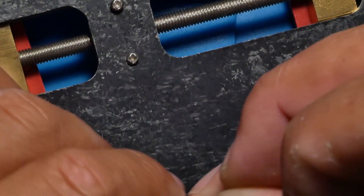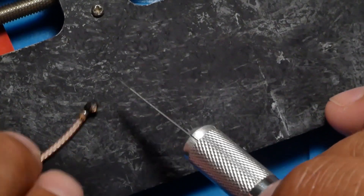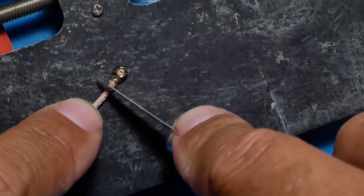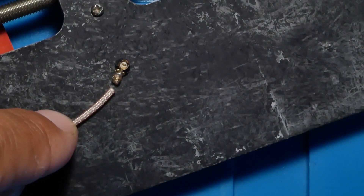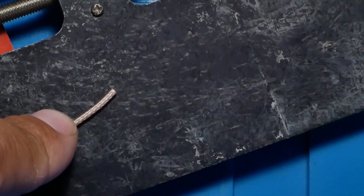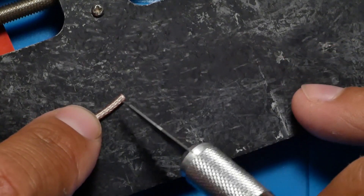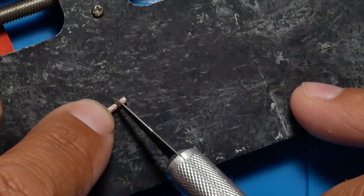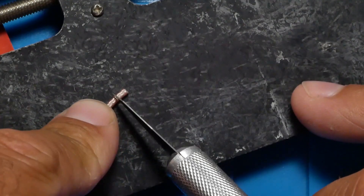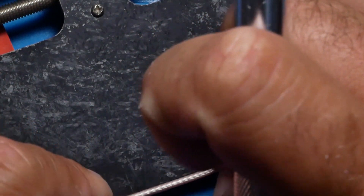The first thing we want to do is go ahead and cut this off, and that's going to consist of peeling this tip. I'm going to go ahead and just slice that right off. This is the old UFL connector — I'm not going to need it, you are not going to need it, so get rid of that. The next thing we're going to do is cut through the top layer only. Don't go crazy — just cut enough so that we have something to grab with. Go ahead and slice and spin, get all the way around, and you should be able to just pull that right off.